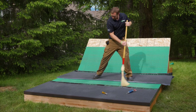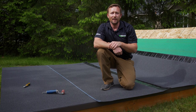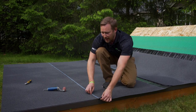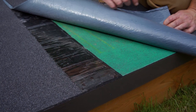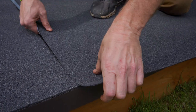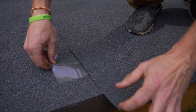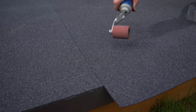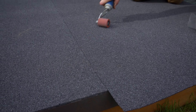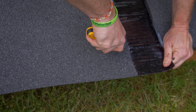It's very important to make sure that the roof deck is clean while you're installing the cap sheet. Make sure it is properly swept as you work up the roof system. Now that our first course of the cap sheet is installed, we're putting in our succeeding sheet. You can overlay this right over the selvedge edge, but I would add about a quarter inch to make sure that the selvedge edge is not exposed. Malarkey uses a double-sided release film, so you can apply the back coating directly to the release film without it sticking. Now you can remove your release film from your selvedge edge. Using the metal edge as a guide, you can cut the cap sheet with a nice clean cut.